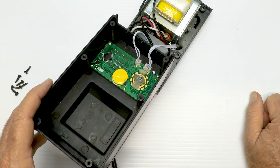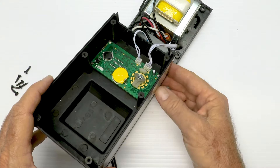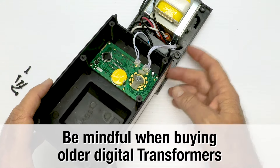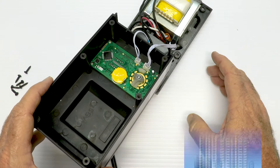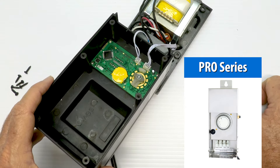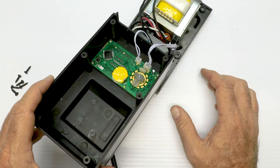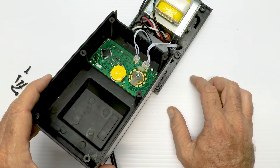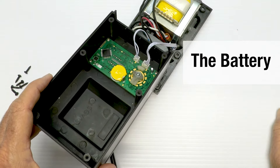All rechargeable batteries will someday fail, and that's what's happening here — the battery fails and the circuit doesn't work anymore. When it goes far enough, it can't recharge or even operate when power is coming to the unit. I want to warn you about this on these older transformers that have batteries in them. Our pro transformers don't have batteries — they're all analog with magnetic transformers. So now you know what's going on with your Malibu transformer that may look great but just doesn't work anymore. The culprit is the battery.